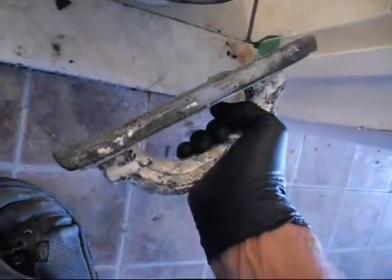The last little bit of grouting. You're supposed to use a sponge like this, a hard rubber sponge, but I like doing it better with a putty knife. Scrape it in both directions to make sure it fills the gap fully. You let it dry for 10, 15, 20, 30 minutes, depending on your exterior conditions. If it's raining, damp, hot, windy.